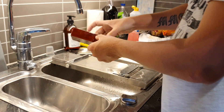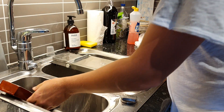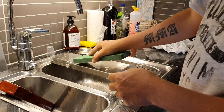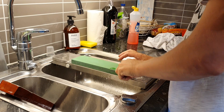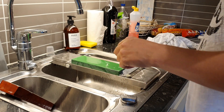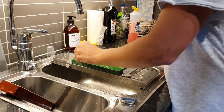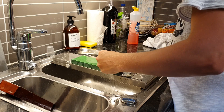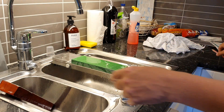Just putting it to the side, rinsing it off — you don't want any dirt on it. Going to a Naniwa Professional 1000 and then afterwards a Professional 5000. I'm not gonna bother shaving with other grits if I can make it shave off a 300. Of course I can make it shave off a 1000 — that's a given.